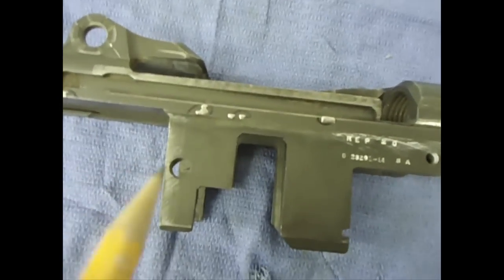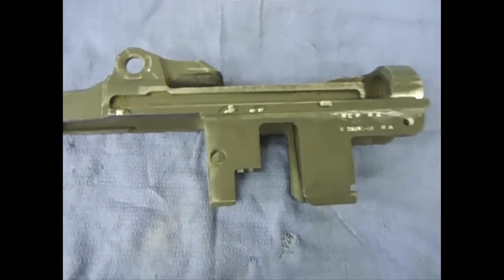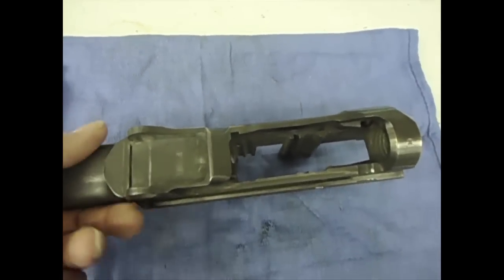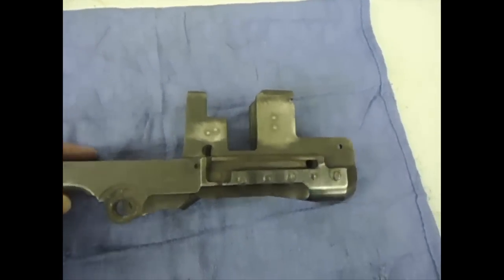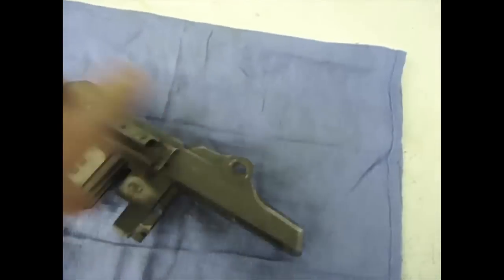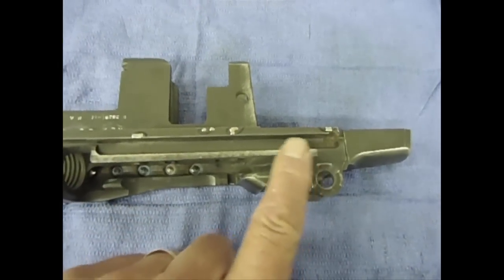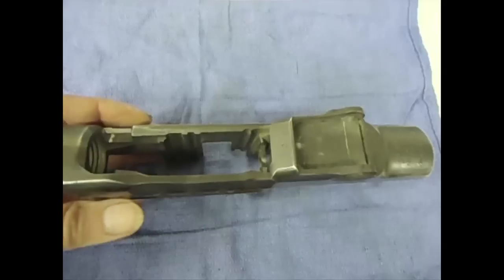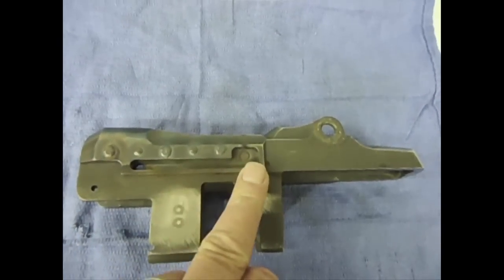I had a little bit of TIG added. There were a few dings, little gouges, so I had them just build it up a little bit with TIG weld. Now the next operation is to send the whole receiver out and get it annealed so that the original steel will soften and the new steel will soften as well. So in theory, hopefully, once I get all this filed and get it back to nice and level, there's not much else that this receiver needs - just that and those few little spots we did over there. Get those done, and like I say, that's going to be tricky.